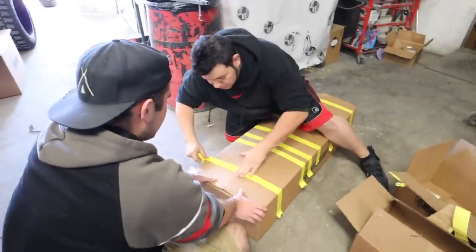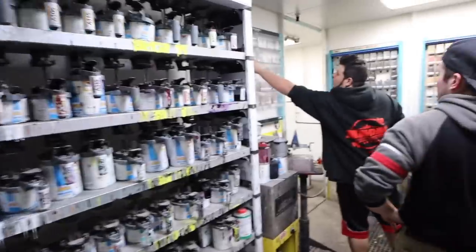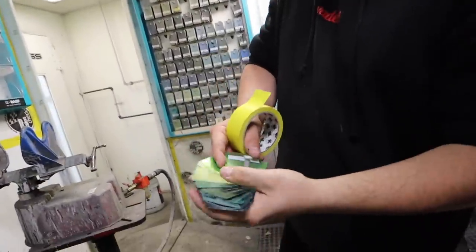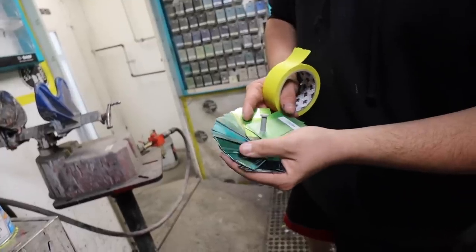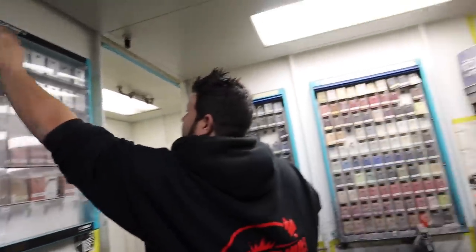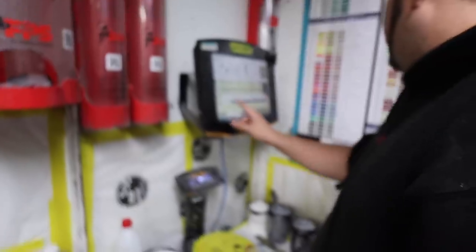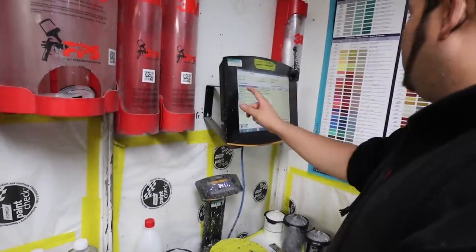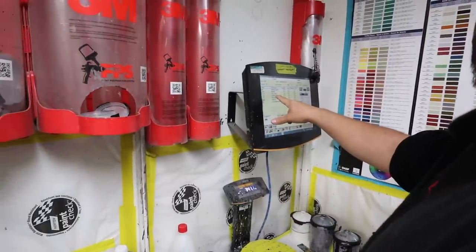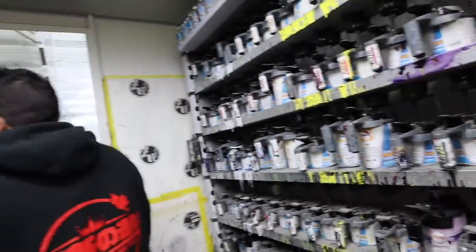They go by pigments and weight. These are little chips. Those are the greens. Some of the greens, all kinds, every color you can think of. You just go on the computer and it tells you how much of each pigment. It's called green angles. There's no chip for this one. There's only one formula for it. And this tells me what's all in it. It's got a lot of yellows: white, yellow, yellow, yellow, green. And that's how you make it. If you overpour or underpour, that's how you get bad color matching.